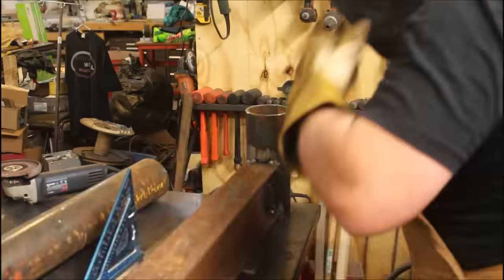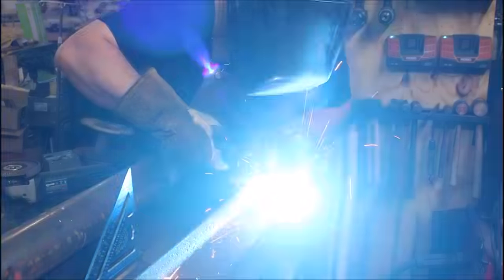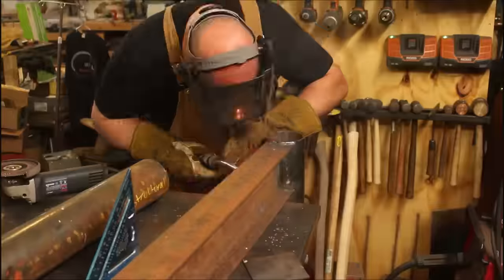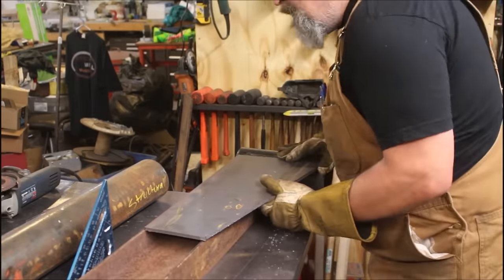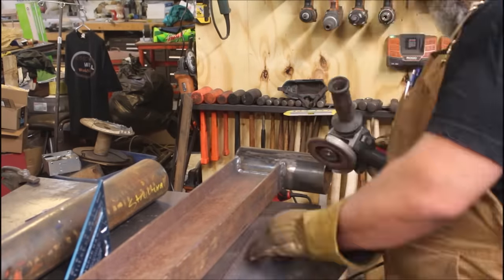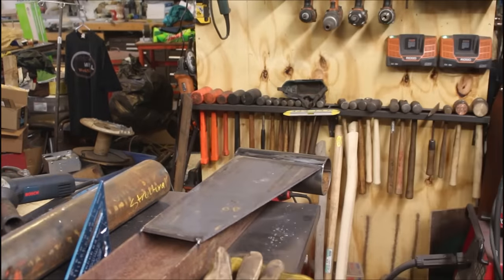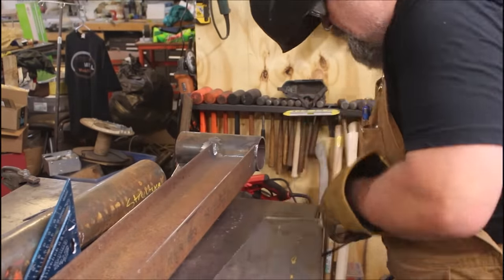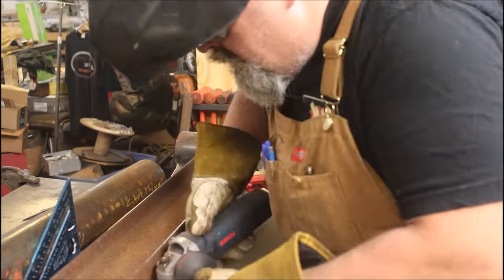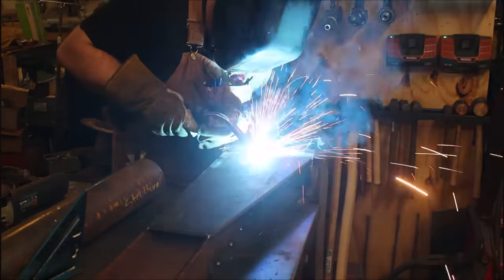Pivot tube to the beam now. I've got the beam up on some little blocks so I can get a weld on the top side. Rolling it to do everything in as flat a position as possible — that always makes welding easier. Cleaning it up a little bit; there are those support plates. Lots of tacks on these. Clean up the other plate — removing any scale, rust, or anything that might interfere with the weld. More tacks on the inside, then time to weld it all out.